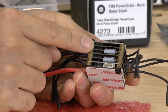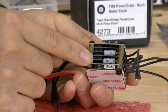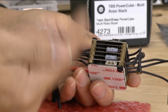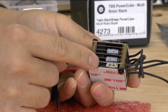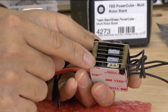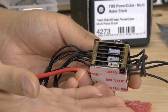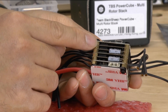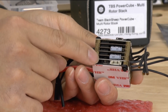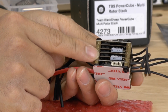The ESCs in here are rated for 20 amps. They can go up to 30 amps continuous if there's good airflow, and can burst up to 45 amps for a short period of time. Interestingly, the power distribution board is rated for 100 amps continuous bursting up to 150 amps. If you were using 30 amps continuous on all four ESCs, that would be close to the 150 amp mark — so technically the PDB isn't rated to handle all ESCs drawing at 30 amps simultaneously.